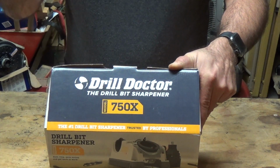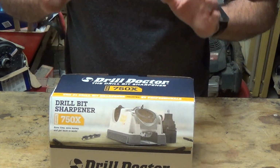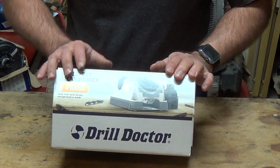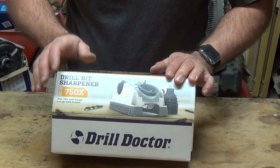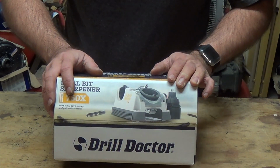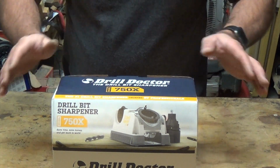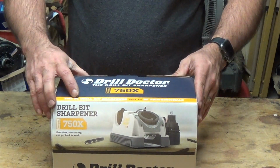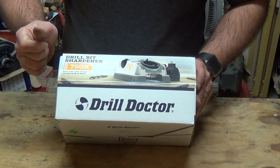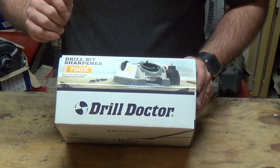That's pretty awesome. I probably will keep it mostly at 118, but I've got lots of drill bits now. If you saw one of my previous videos, I'll probably have some sharpened up for different angles, because I do work with stainless steel, but most of my stuff will be aluminum and just square tubing. So I should be pretty safe with just keeping it at 118. This also will sharpen a split point, which they didn't really have as an option before. I'll show you what that entails, and whether or not I like it.